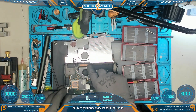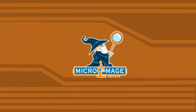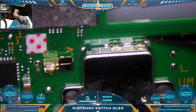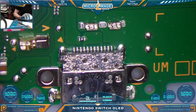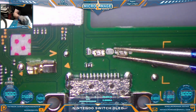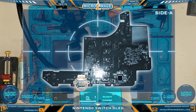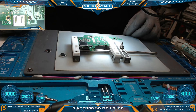That's pretty heavy duty adhesive. First thing we'll need to do is remove our shields - these little tabs bend pretty easy, you'll need to bend them back into place before you put the shield back on. Go ahead and do that now, and we'll need to do the same for the bottom shield. We have the board out of the housing. For orientation purposes, we'll begin our work on side A, and when we flip to side B we'll be here.